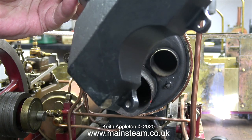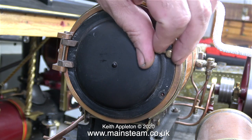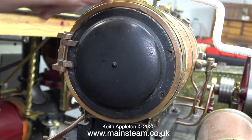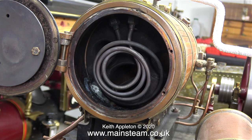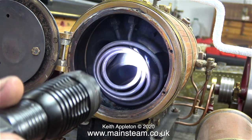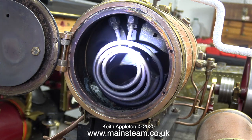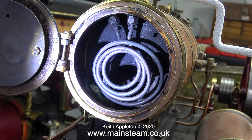The inefficiency of two plain flues is more than compensated for by the complexity of the radiating water tubes in the center flue. I don't know what this boiler is, but it looks like a commercial unit — either way, it's very well made. Turning the boiler around, I'm going to show you what's in the other end. Fastened to this door is a baffle plate, which is definitely required as a heat sink because the gas burner is directly pointing down the center flue at this door. And there is also a coil of copper tubing — this is a superheater coil, and as it's very close to the middle of the center flue, it's heated directly by the flame of the burner.